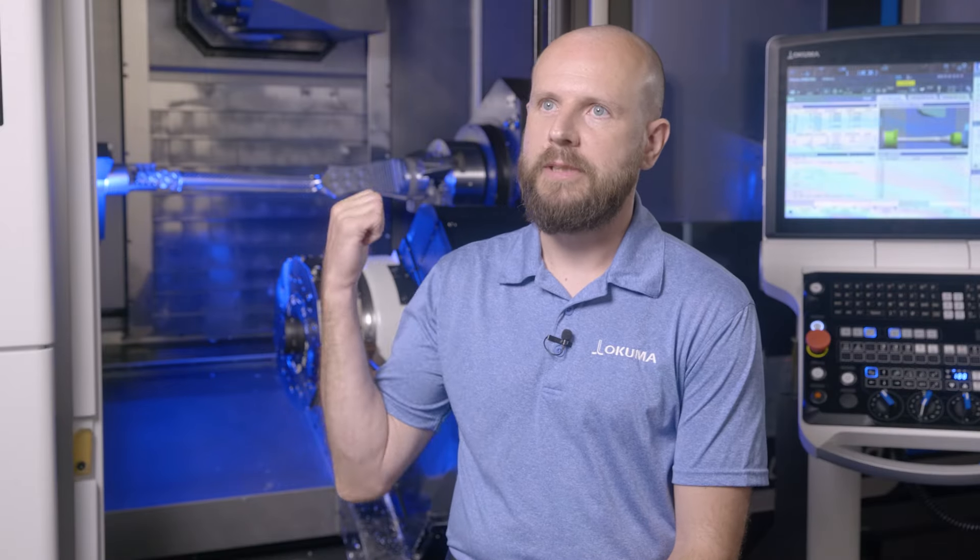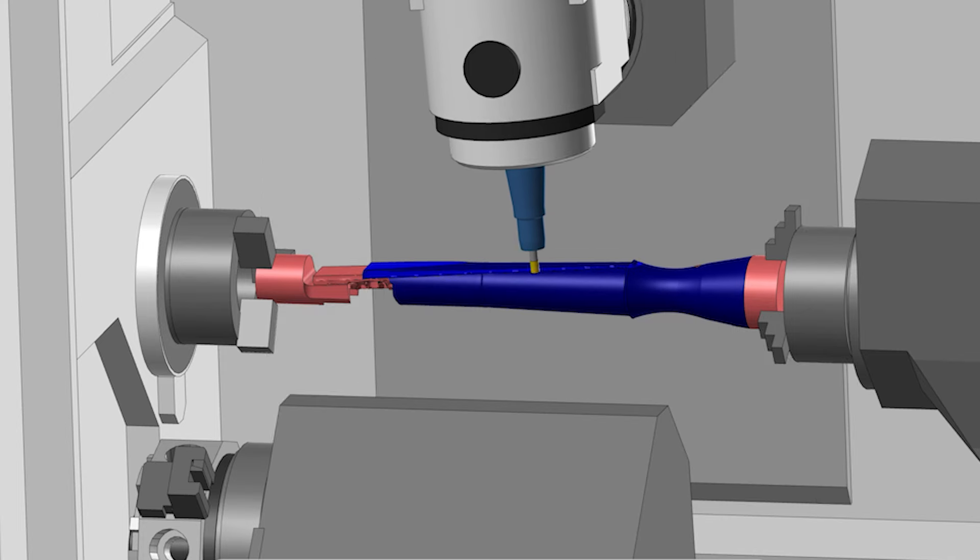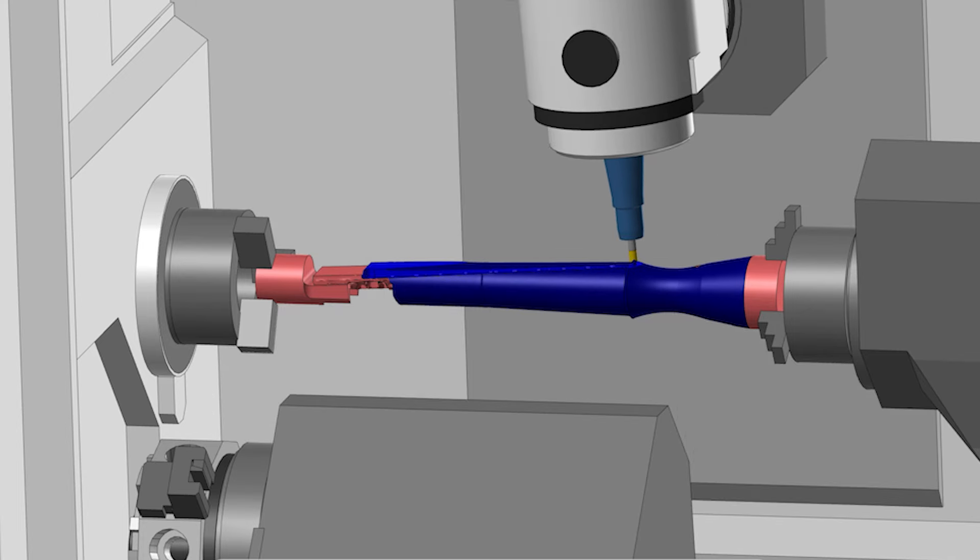One of the challenges we found when we were roughing our stock down is that we were using a tool path strategy that put equal loads along the part and down into the part. We were able to use the OptiRough out of Mastercam to put a lot more side load on the tool, which then directed all the loads towards the chuck instead of into the workpiece. Switching to the OptiRough tool path was very straightforward — it quieted right down and we were actually able to remove a lot more material quicker and quieter.